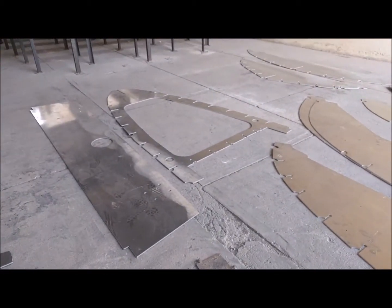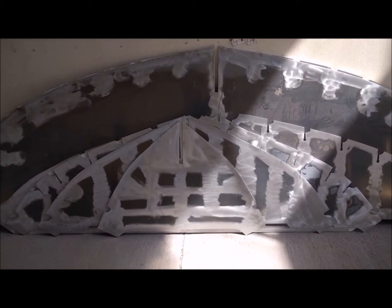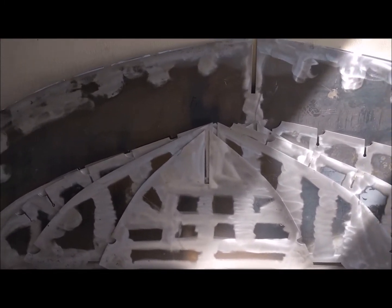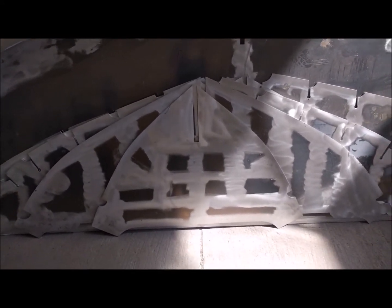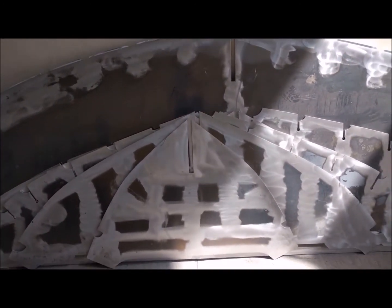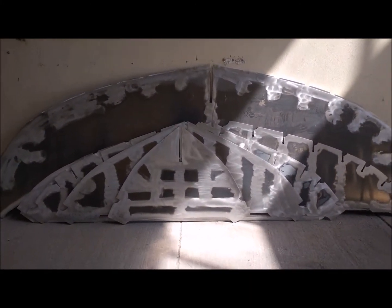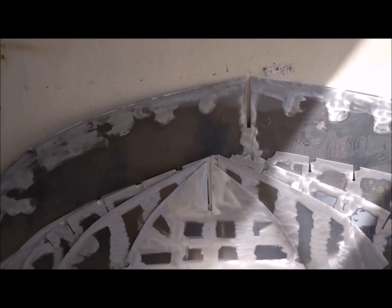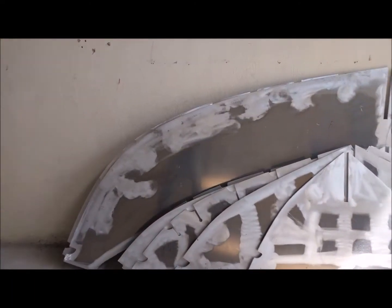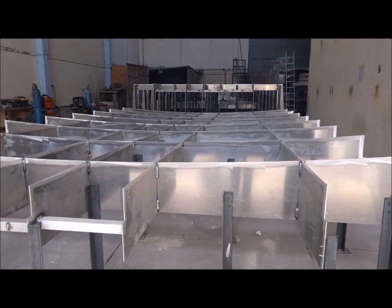That's your update for today. Got these hull plates stacked up now so you can get a nice graphical view of how the hull shape changes. This piece right here in the foreground is going straight down the hull side, so all of these are showing you the shape of the bottom of the hull. This one in the foreground, the smallest one, is closer to the front — that's frame number three, so three meters back from the bow. It gives you an idea of the steepness at that point. And then that big one in the background is frame number 12, which would be part way through the main salon area. You can get a sense of how it's a different kind of curve from the hull plates and the shape of the bottom.